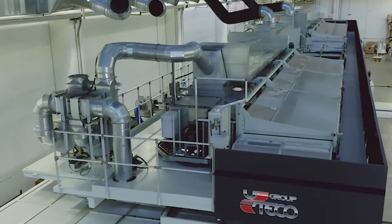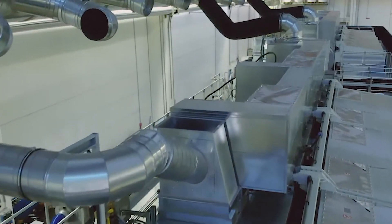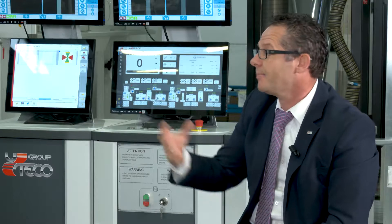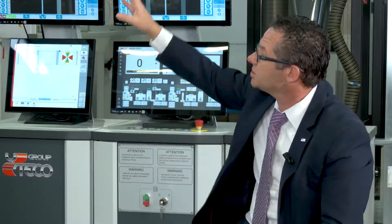Talking about another innovation, the Horizon also uses an exclusive patent cube ventilation system built on top, which grants peak performance combining low noise — which is important today — energy saving, and best performance. This machine is equipped with two ventilation systems, one on the left side and one on the right side. Each is composed of three separate zones with their own individual burners, with a semi-flotation drying system, which is very important in coating and lamination today.